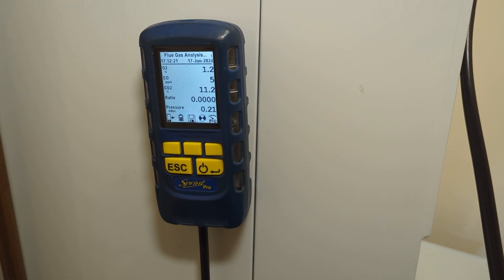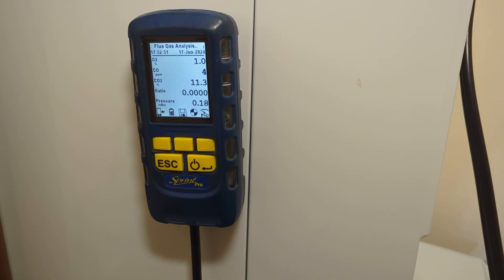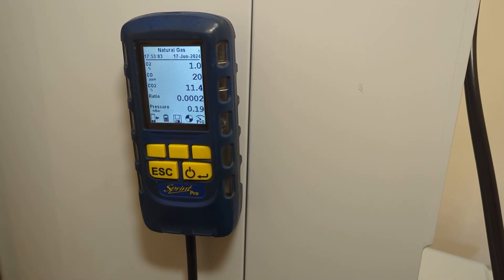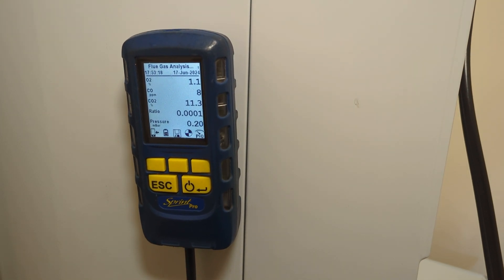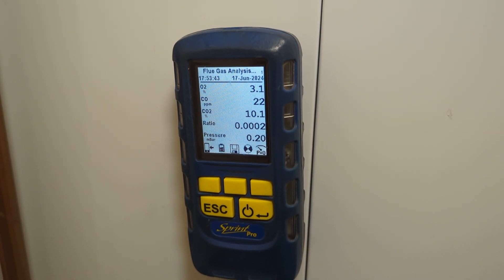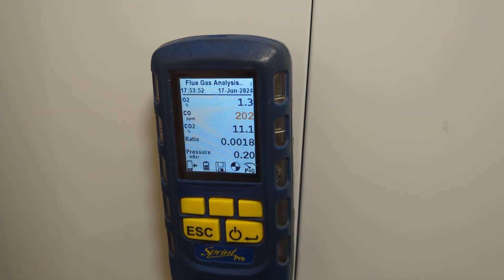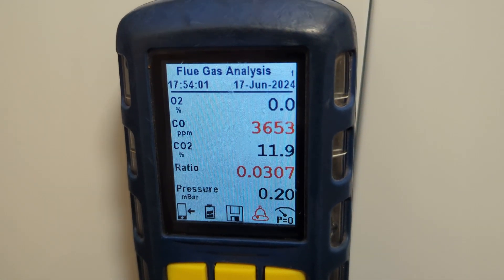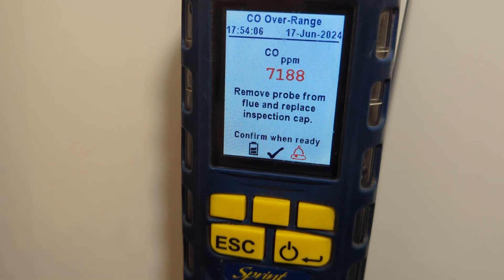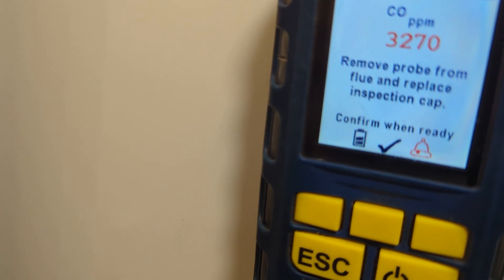In a minute you will actually see the readings go off the scale. The readings have sort of stabilized, and you would think they're just not great — maybe you'd write them down and get on your way thinking they're not as they should be. But if you'd waited long enough, this would have happened: you're getting readings in the thousands. Again, according to Vaillant, it's in calibration mode and you should not have put your analyzer in.